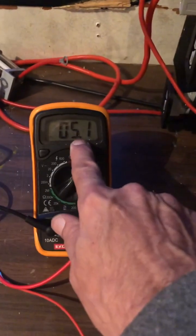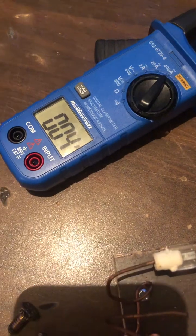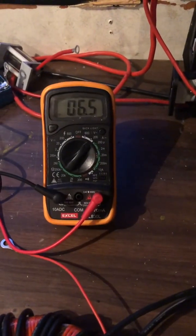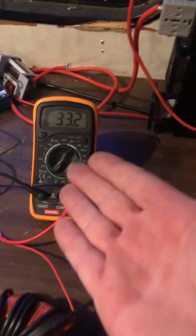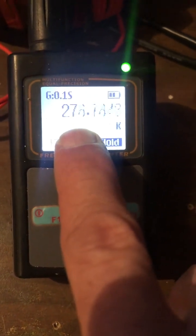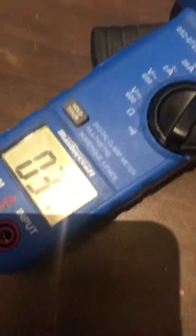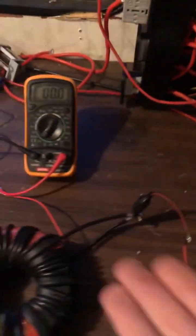It hits about 10–12 watts and then pops right into 30 volts output with 37 amps. It doesn't always happen on the second flick — perhaps it takes a third. There it goes: seven volts and it instantly popped into resonance. 2.4 watt input, 141 kilohertz and climbing. It accelerates until it starts ringing. My finger seems to affect the reading quite dramatically — 134 kHz — and look: 37 amps, 33 volts, 2.4 watts. Turn it off, turn it back on — does not start again.